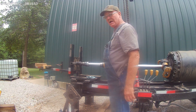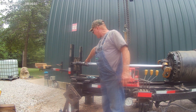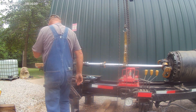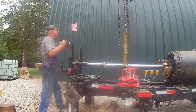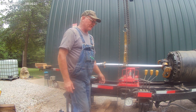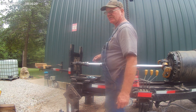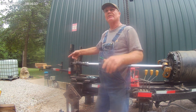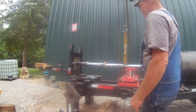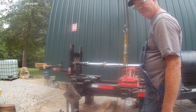Now that we've got our rod turned around, we've pinned our rod into this end. We've got a 2 and 13/16 socket, an inch and a half adapter, and that inch and a half plate on the end. We'll slide the collar down on top of it and hold it into place. Now we're ready to break that nut loose and turn it off. We've marked the bolt so it's in line with the grease fitting on the rod end, and now we're going to turn the rod off of the nut - about two rounds to get it real loose, then we can finish taking it off by hand.